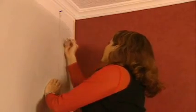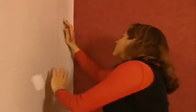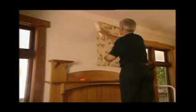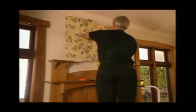In our planning, it's important to think about the ideal point at which to start. Where you start is subject to the design of your wallpaper and your room. The general rule is to start in a corner and work away from the main source of natural light, with the aim of finishing in the least noticed corner. However, if hanging a wallpaper with a distinctive pattern, it is important to consider the room's focal point. For example, with a centrally located fireplace, the first join would need to be centred and the succeeding lengths hung in the direction of both corners.